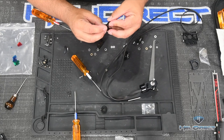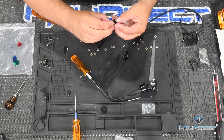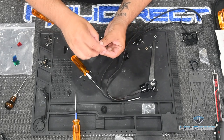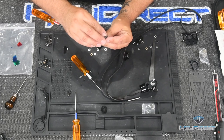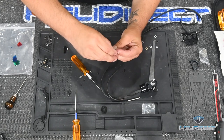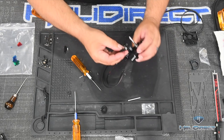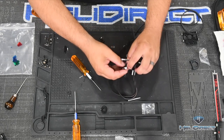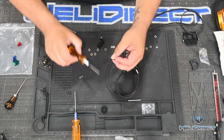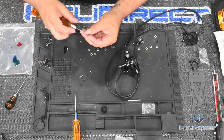carefully here. And the flange goes on the inside here, so there's one. And here comes number two. It's a little tricky here. Get on in there. And there's number two. Great. So now we can slide this back over our tail pitch lever arm. Just gently rest it there, and we can get some Loctite on these bolts. In this case, I'm going to use blue because there's two bolts, so it's not a single point of failure here.